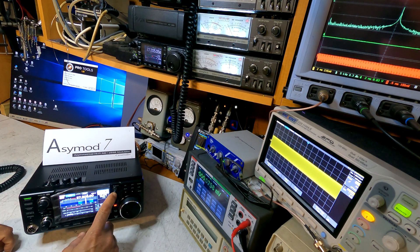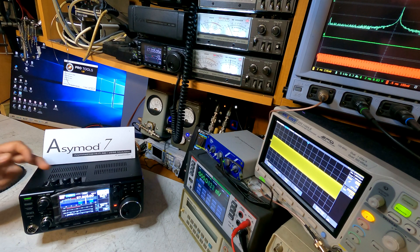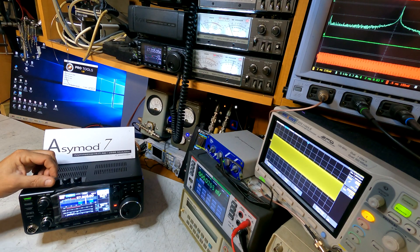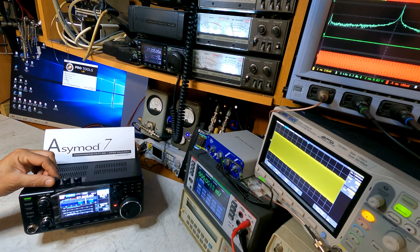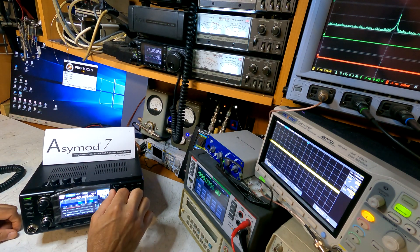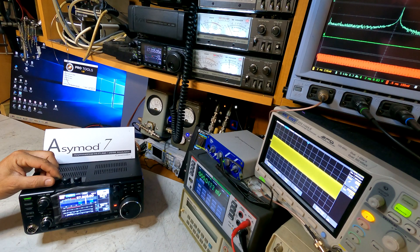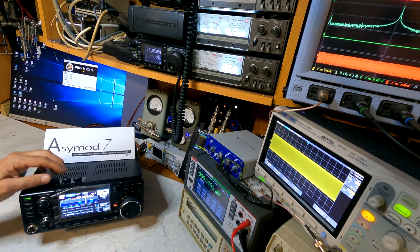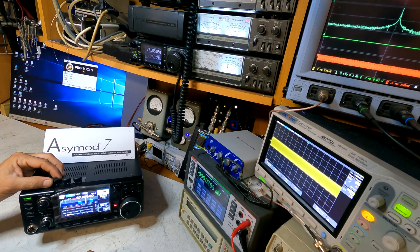At this point, we have our RF power set to 83%. At 83%, this carrier level will give you a range from 0 watts to about 20 watts of carrier — full scale is 20 watts. The other setting I recommend is putting your RF power to 48%. This carrier range will give you a max of 10 watts, which is what's recommended for this radio to maintain your headroom. I wouldn't go past 10 watts of dead key on this radio. So let's set it — leave it at 48% RF power and put it at a 3-watt dead key.